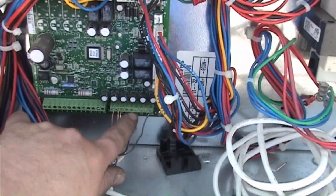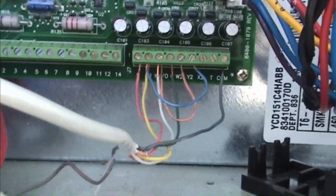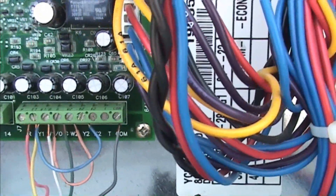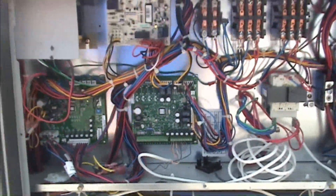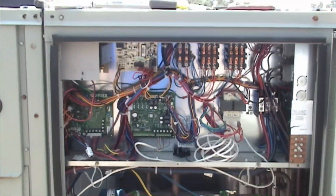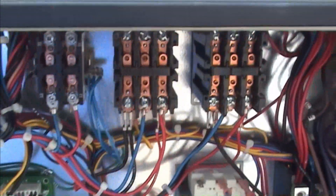Let me hook in my second compressor — I had to unhook it yesterday just to get the unit running. Let's hook that in and see if this motor runs the right direction. We got power out of the unit — they're on a delay. Now all of these right here are your thermostat wires, and if you look they have letters on them that basically mean different things: R is your power, Y is cooling, W is heat, G is your fan, and common is a 24-volt neutral — when you have a thermostat that's powered off the unit itself, not just batteries. All newer units and newer places have digital thermostats now, because apparently mercury is bad and they don't make mercury-switch thermostats anymore. Wait for this delay here and you'll be able to see these contactors popping in.